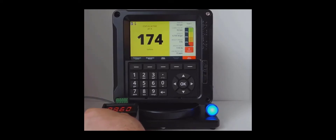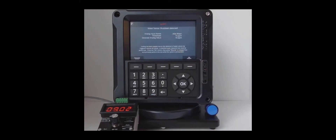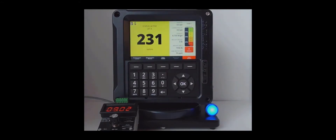Our first trigger value is set to 15 parts per million. So once I get above 15 parts per million, after the 10-second delay that's built into the software, the system will pause the delivery. Once the delivery has been paused, you'll notice that the alert screen is displayed on the IQ register, and also that the blue indication lamp is now flashing slowly about once per second. The screen shows an alert for the fueler that water sensor shutdown has been detected, displaying the threshold of 15 PPM and the value the sensor was reading — in this case 16 parts per million. It recommends that a chemical water detection test should be performed. Once they have done the test and validated the system is OK to fuel, they can press OK, then resume, and continue fueling. The blue light is again illuminated solid.